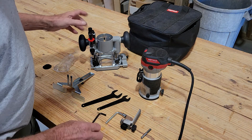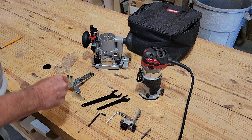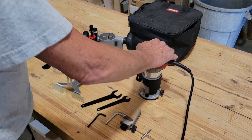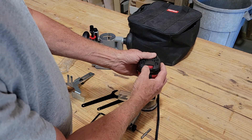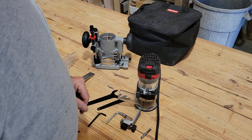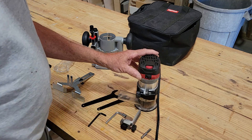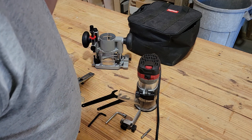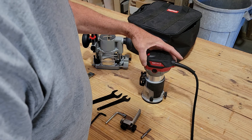It's a one-and-a-quarter horse, 10,000 to 30,000 RPM. It's got a soft-start motor on it, which is a lot easier on the router. It's got six-speed control from one to six. Depending on the size of the bit, you'll want to run at different speeds. If you go to a real low speed for a long period of time, that can cause more issues. If you're running a real large bit, you don't want to run that at high speed either — that's something you need to figure out on any router.